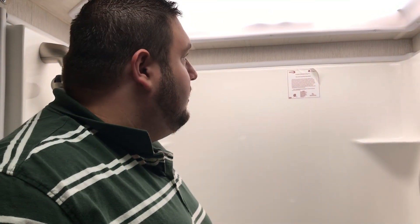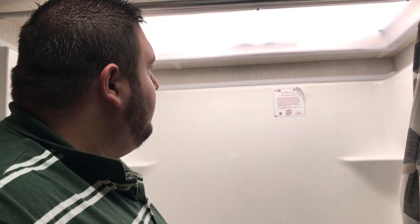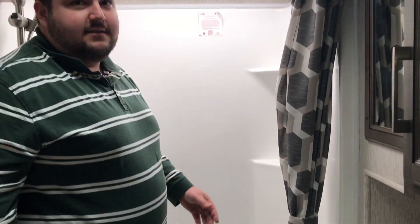With our bathtubs, they come as a two-piece unit. You have the tub as one piece — or shower pan, if that's what you have or prefer — and then you'll have the surround as a separate piece. For the surround, you'll want to measure the height, which is measured from the top of the tub to the top of the surround, usually around 59 to 67 inches.